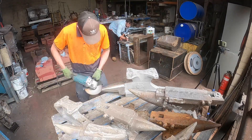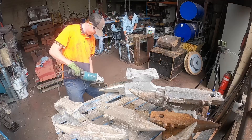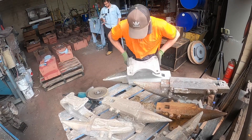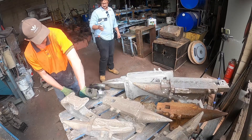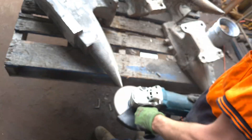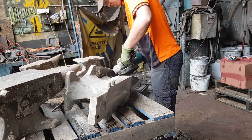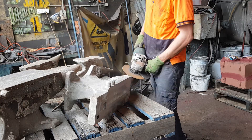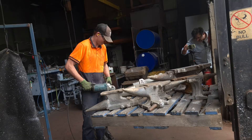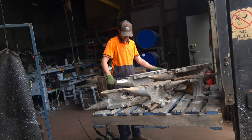We're still working on the horn here, just cleaning out the side. He's just taking the outer skin off the anvil horn. What is that skin? Is that oxidisation? It's a casting skin — it's actually really hard. For presentation and for use it always wears off when people are using the anvil, so it's just nice to take it off and give people a good product.